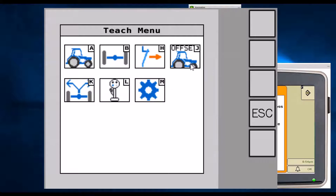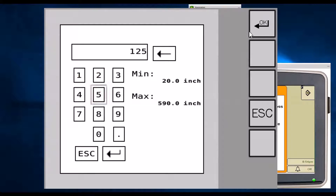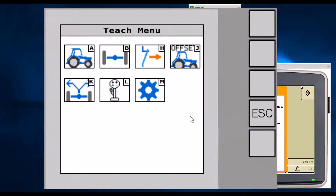The next icon, letter J labeled offset, is the vehicle offset menu. For the Challenger, you put in a wheelbase offset under letter E, consistent with the measurement from the rear axle to the front axle. Letter E is the only value that has influence in the system; letters A through D are only for reference on the GreenStar side. Enter your measured value — for example, 125 inches — then hit OK and OK again to save. Refer to your installation instructions for the proper letter E entry, as it varies significantly by machine.